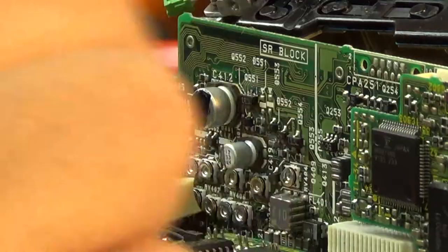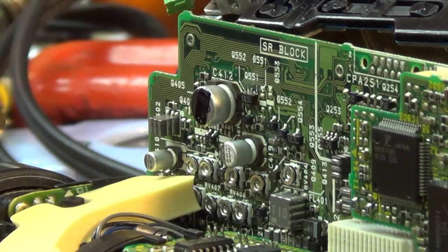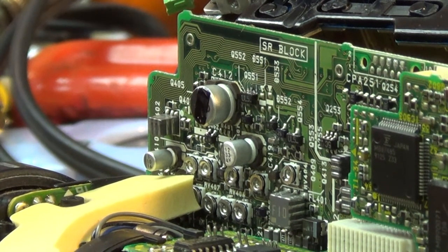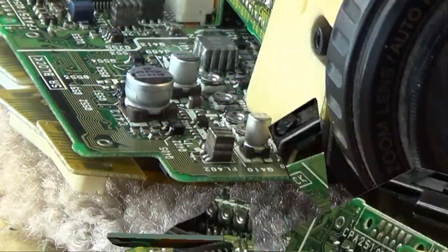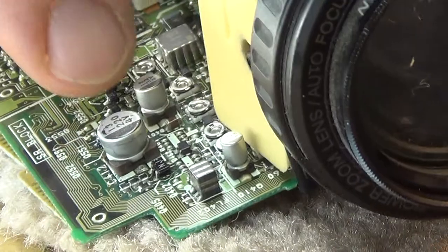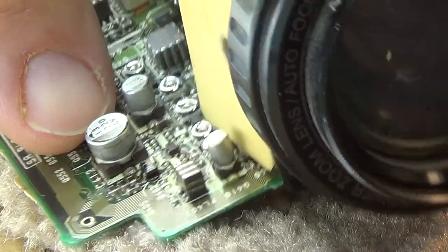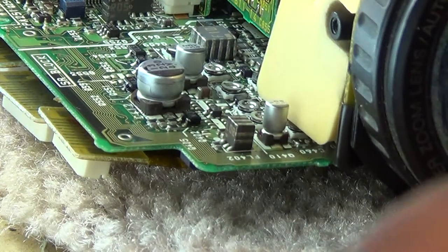Since I've got room to mount a bigger capacitor, that's what I'm going to do. I'll get a power supply for the recording camera first because my battery is shot. I'm going to go in and change that capacitor and fix this camera, then put the guidepost back in. I'll remove the board again. This is the capacitor we're going to change - it's called C412, 220 microfarads rated at 4 volts. I'm going to put a slightly bigger one in.